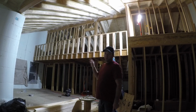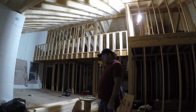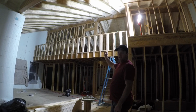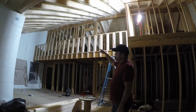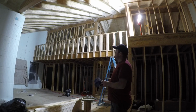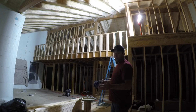That's our rail. We're just gonna sheetrock that, and I think I'll put a wood cap with some little trim on it. I wanted it 3.5 inches deep, because it makes it look stronger. But then I wanted those rails to go all the way down, and I've screwed each one of those in, because it just makes it super solid. And those are on 16-inch centers. So nobody's gonna be breaking through this rail. And my wife's gonna come and shake it and feel like she can lean on it really hard and won't fall through.